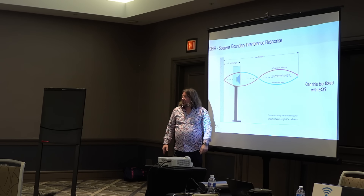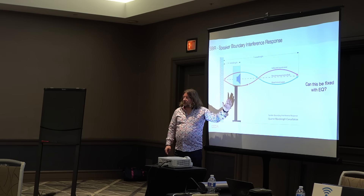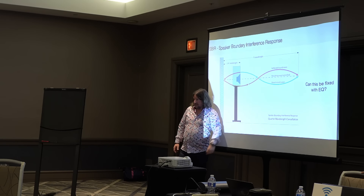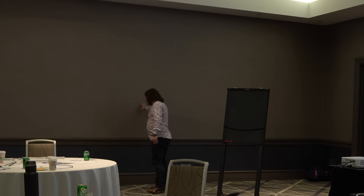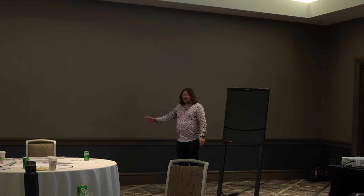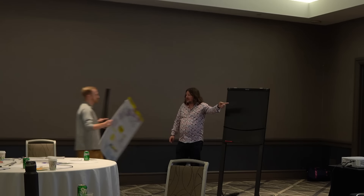You can see that notch. So to cancel 70 Hz, how far away from the wall do I need to have my speaker? One and a quarter meters. Who here has ever been to a hi-fi show where someone has taken a pair of loudspeakers and put them right against the wall — or out in the room — like all the hi-fi people tell you: bring your speakers out into the room, they sound so much better, they can breathe. And then they play something with a kick drum and you're sitting there thinking these speakers are rubbish, there's just no bass, no weight to that kick drum. What's the problem? You're getting this — Speaker Boundary Interference Response.